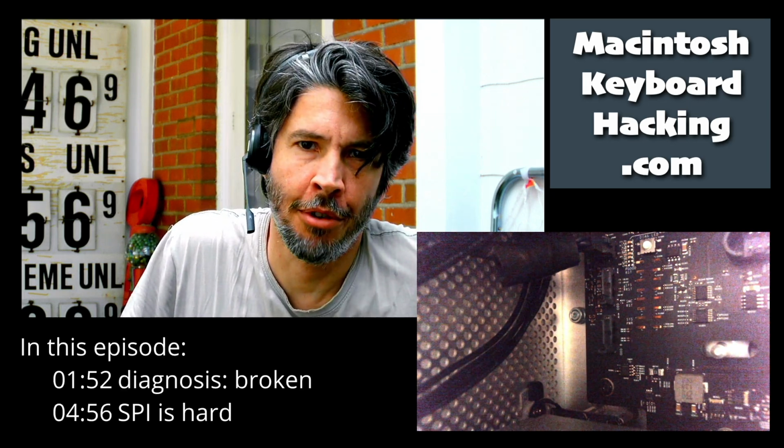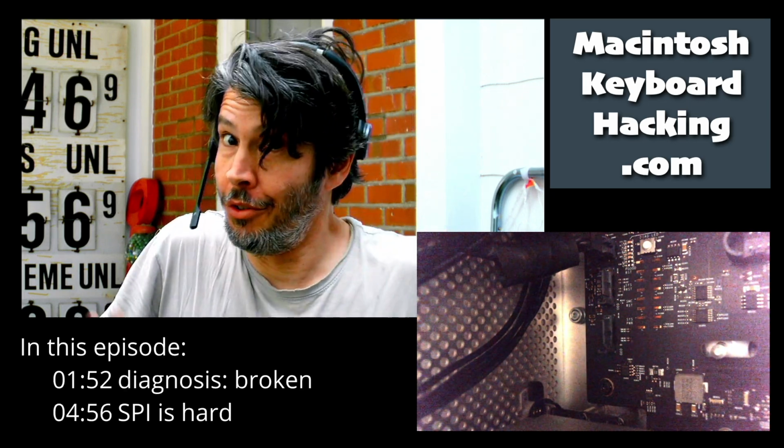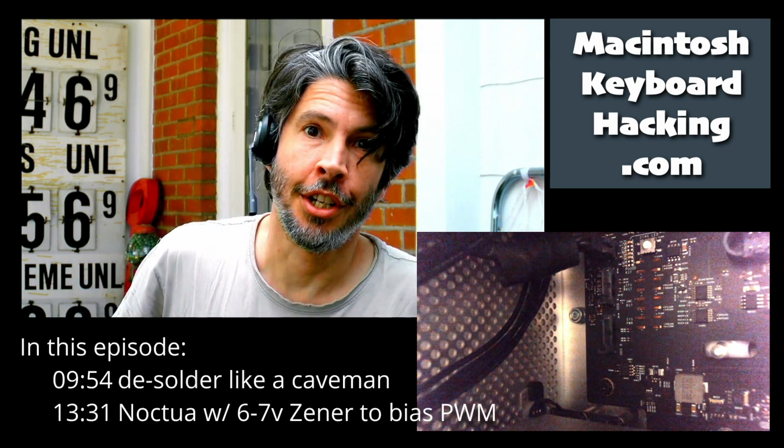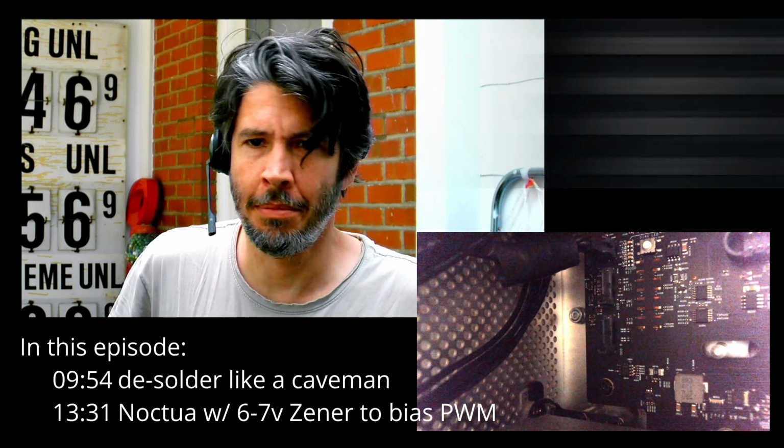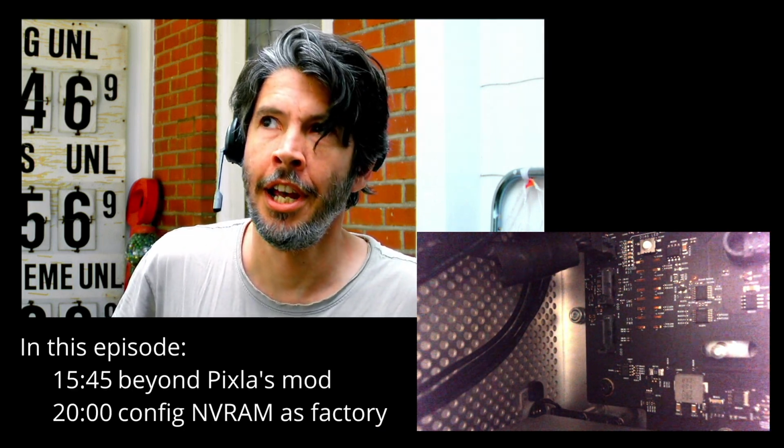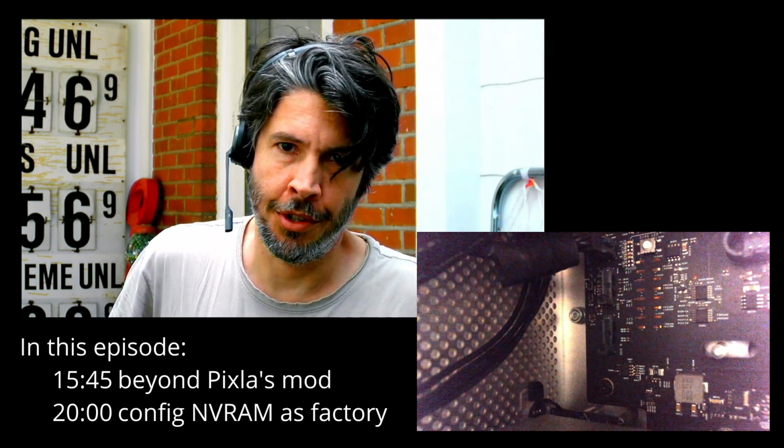My trusty Mac Pro 5.1, which normally does all my stuff with no issue, is turned on just to a flashing power light. That's a symptom it's never exhibited before. No chime, fans just seem to start up as normal. One of the things online pointed to an issue with RAM. I do have a whole other CPU tray I can try just to rule that out.